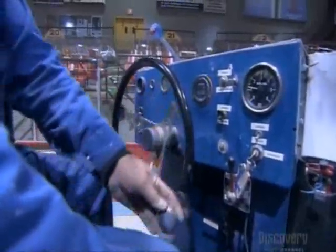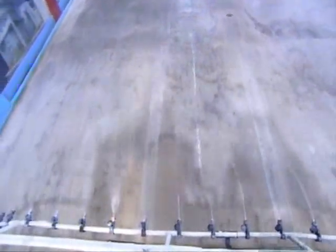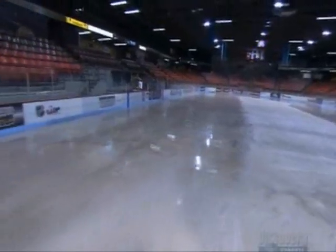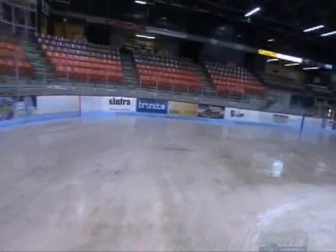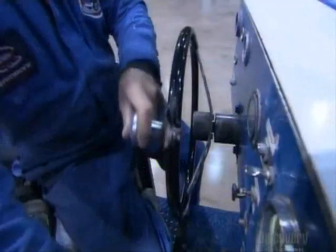This company made its own ice-making machine by retrofitting an ice resurfacer. Its onboard water tank feeds 20 sprayers that mist over a 4-meter span. The water freezes within seconds. To make a quality ice surface, you have to build up the ice in layers, each about 2 millimeters thick. Driving in the standard outside-to-inside oval pattern, each layer takes just 8 minutes.